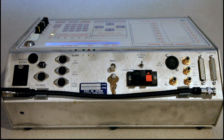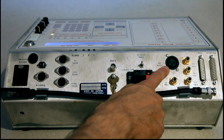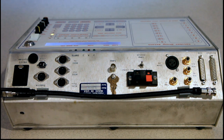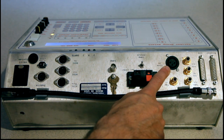Please be careful and pay attention when connecting your system prior to showtime, as the line in for timecode has the same XLR type connection as your firing cable connection, which is on the right side of the controller. Remember that your firing cable gets connected to the back right of the controller, and your timecode cable gets connected to the back left of the controller.